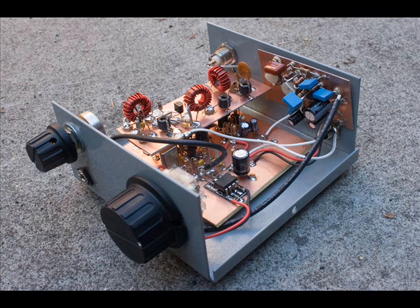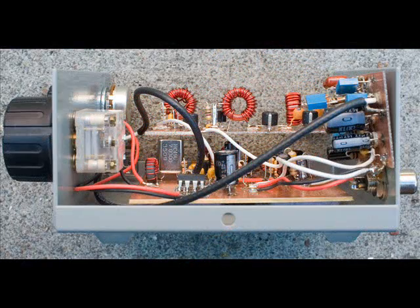And secondly, my VRX-1 is a bit of a hot mess because it was sort of a project in progress. If you look at it, you'll be able to see on the back wall of the VRX-1 the peaked low-pass active filter designed by W7ZOI that I added, and also on top of the main board you can see the common gate RF preamp. Both of those circuits, by the way, I got from VE7BPO's website.